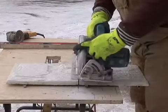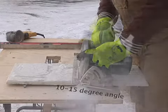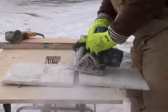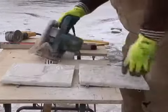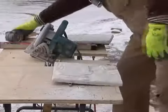The reason for this is that often your cut butts up to the tiles or moldings, which of course all have tapered edges of about 10 degrees. The second reason is that if your cut is not perfectly straight, it will be a little more forgiving, and this way you will get tighter fits all around.